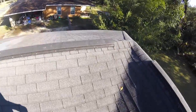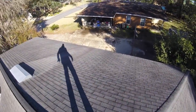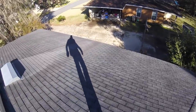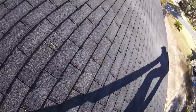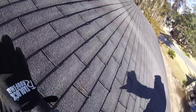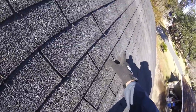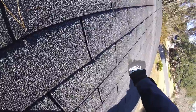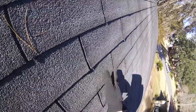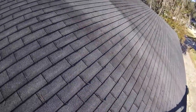I was not able to find exactly where the water is getting through and dripping down in the computer room. That may be due to the curling of these tabs — what happens is when water is sheeting down this roof, instead of sitting flat, it's raised up and curling, so water is able to get up underneath there and ultimately get on the nail below. That may be what's going on.